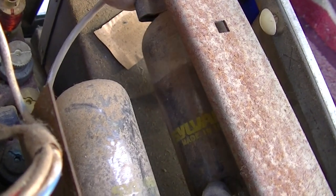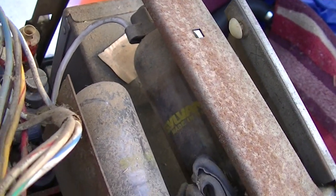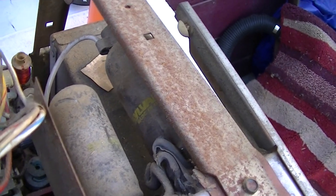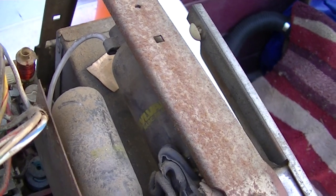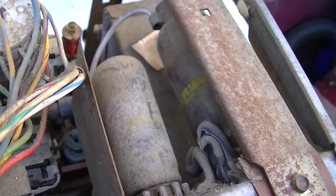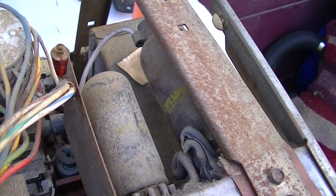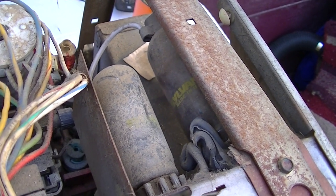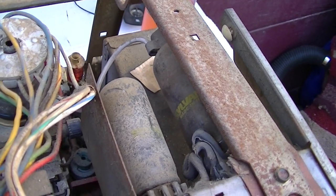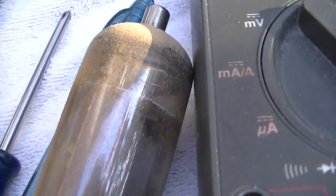And that's going to be some high voltage filament voltage series string tube I don't have. That's probably also used for CB radio linears. It's like $200 on eBay. And the schematic says it's a 20LF6, and that probably is, because a 6LF6 is a $200 CB radio linear tube. So, crap. And it is a 20LF6.